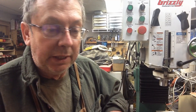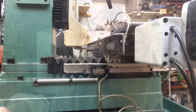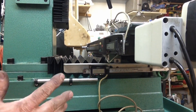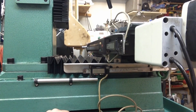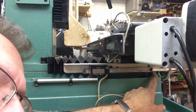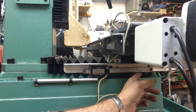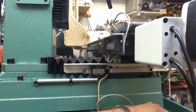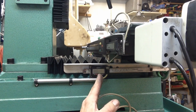The problem is you run out of travel and it'll run the scale reader off the bar itself. So I'll show you the solution I've come up with for now. I've used the same mounting system as before - the same angle iron bracket, set up virtually identical. The scale is protected by the angle iron. I just mounted it at the upper end, spaced the scale off so it doesn't contact anything on the angle aluminum, drilled and tapped into the aluminum with a socket head cap screw.